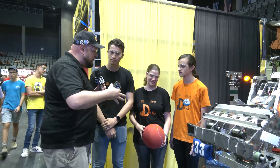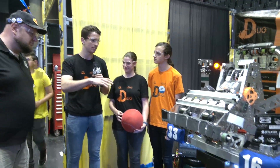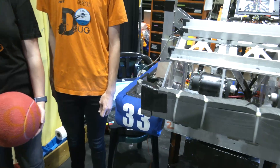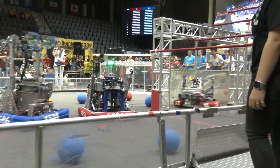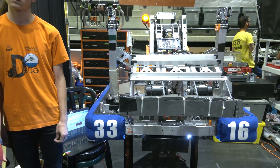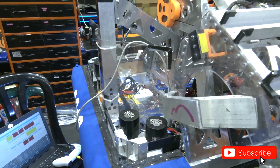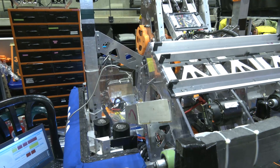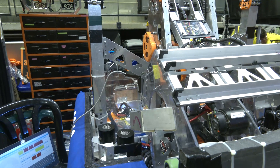Let's start off talking about your drivetrain. You've done some modifications customized for your robot on the Mark IV. Our drivetrain is composed of four SDS Mark IV modules. Each one is protected with shields we had to produce after our first district championship, where a robot came across us and yanked off a whole motor. We also have 3D printed protectors for debris on the field that protect the electronics from grease and things like that. The Mark IVs have been very reliable and heavy duty — a joy to repair. Shout out to SDS.